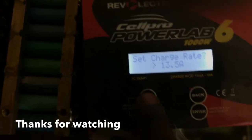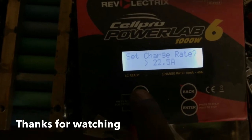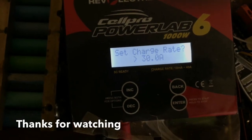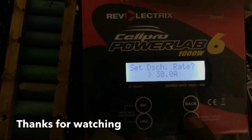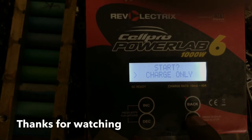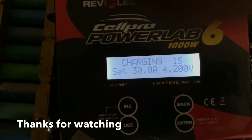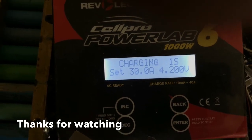If I want to charge at 20 amps I can press increase to charge faster, or I can set it to 30 amps. Most of the time I charge at 20 or 30 amps. So let's set it to 30 amps now. Press Enter on charge rate. It says 'discharge' — I don't care about that. I want to charge, so I go to 'start charge only' — yes, that's what I want. Press Enter. It checks the pack to confirm everything is connected, then says Enter to confirm. The battery will be charged up to 3.65 volts at a rate of 30 amps, 1S.